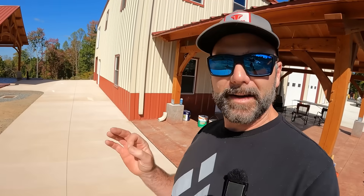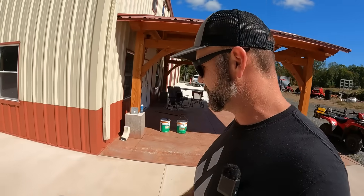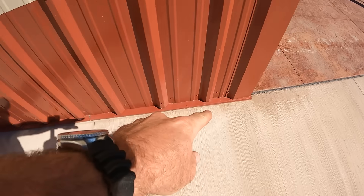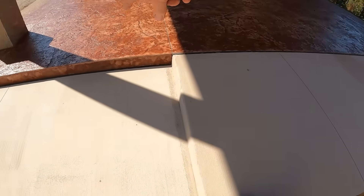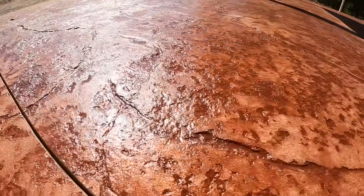So we're all blown off and we're ready to start cutting in. We're going to take that El Cheapo paintbrush and go right along the edges where we need to cut in. There are a few special spots here — right around this corner we need to cut in nice and sharp. We'll cut in down the edge right here. If we get a little bit on the building, it's not going to be a big deal. We're also going to need to get our brush and cut in right here in this groove — there's a slight curb here so we've got to get in and protect that all the way to the stamped concrete.